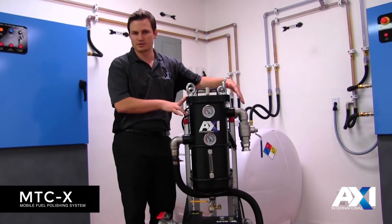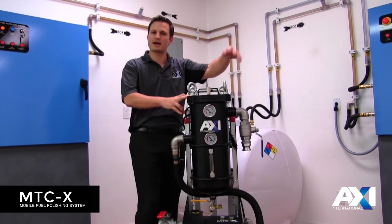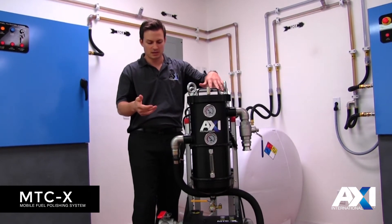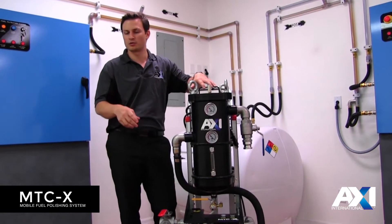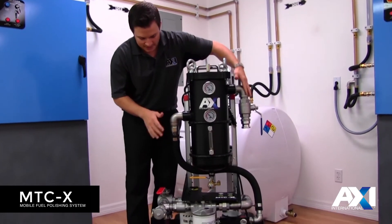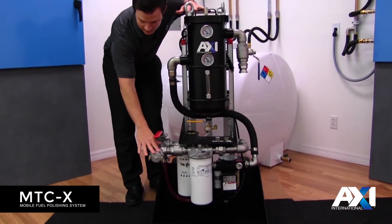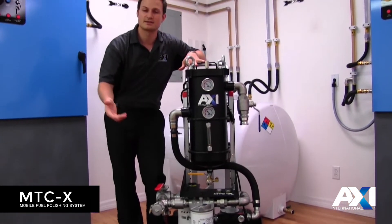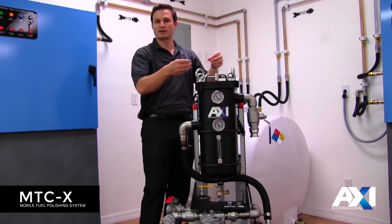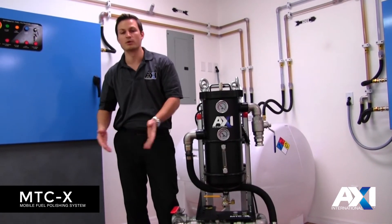The system comes with a 25-foot clear suction hose. You'll attach the suction hose and drop it into the tank at the worst spot — the lowest, most dirty spot. You can use a downpipe or a wand to reach hard-to-get areas at the lowest portion. With that inside the tank, keep your diverter valve in bypass mode and connect the discharge hose, but instead of putting it back in the tank, put it into a separate holding container so that what you pull off the bottom isn't returned to the tank.